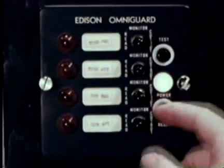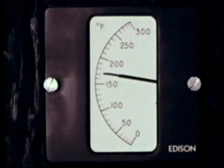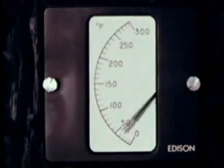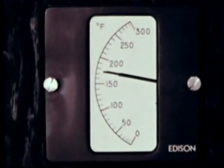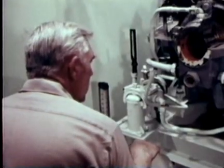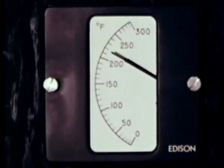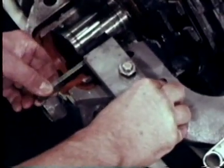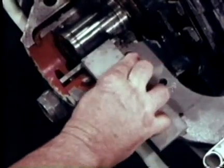When the RTE monitor shows the expected readings, operation is normal. When the monitor shows a higher than expected temperature, a careful watch should be maintained. Unexpected and unexplained increases in temperature may warn of a serious problem. If the trend continues and no external reasons for the temperature increase can be found, it may be necessary to secure the machine. If the monitor shows a red light, the temperature is at least 25 degrees over the maximum. When disassembly is required, be very careful not to distort the bearing shell — a simple bearing jack will roll out the shell without the use of hammers.